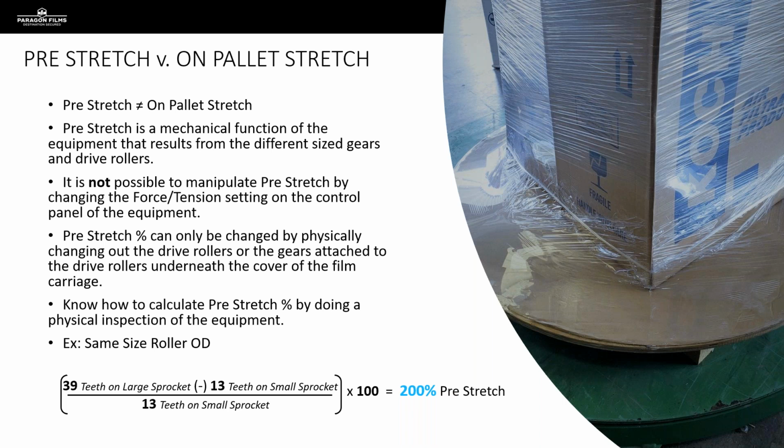And then it's very important for us to know how to actually calculate pre-stretch when we're on site in the field with our customer, because they may not always know what they purchased that equipment at, or if there were any changes made to it. So a very simple example, when we're dealing with a piece of equipment that's got two of the same size drive rollers, would be we count the teeth on each one of those sprockets or each one of those gears, and we do a little bit of math, and that will tell us what the pre-stretch percentage is.